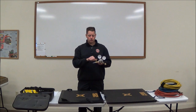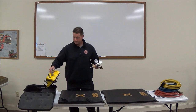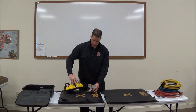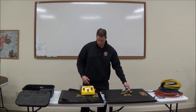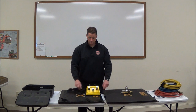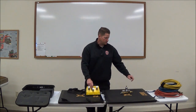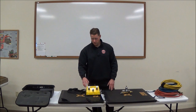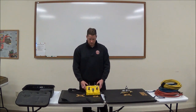We have a shutoff on the outlet. The hose connects from the regulator to the dual controller at the middle connection. The air going out to the airbags comes from the two outboard connections. They're all color-coded: the hose from the regulator to the intake is yellow, the left side controller is red, and the right side controller is blue. Color-coding isn't necessary but helps avoid confusion. This is a dual controller — it controls two airbags at once using a joystick.